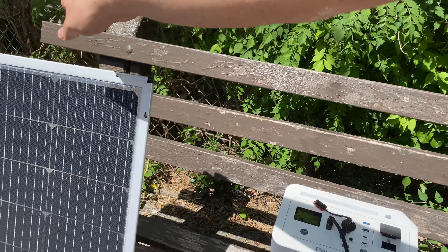Let's check open circuit voltage. In real life it looks like about 21 volts on this side facing this way, and it is 20.99 volts facing the other way. Excellent — both sides show virtually identical open circuit voltage.